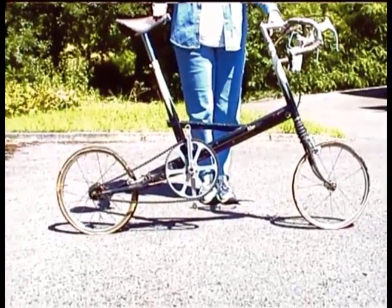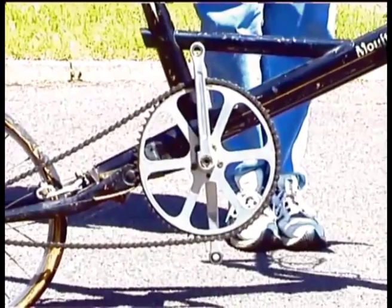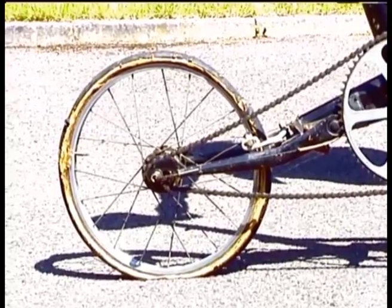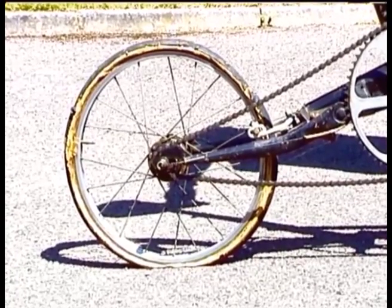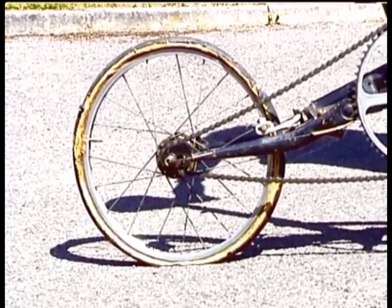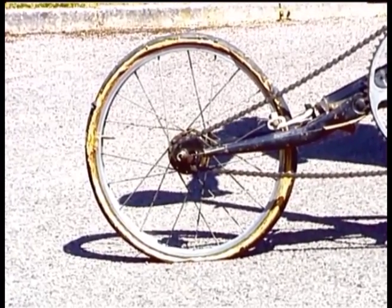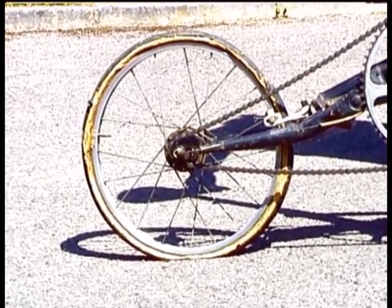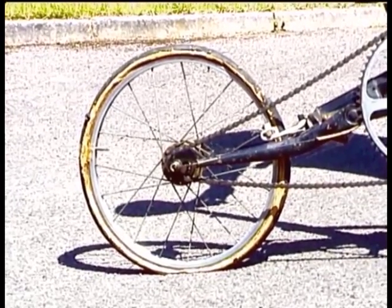You've got the big chain wheel there, which we'll zoom in on now. Quite a nice little beastie there. And that was driving a Sturmey Archer FC close ratio 4-speed, actually a 1958 one, because by this time those had gone out of production. Now you can see some very tatty looking tyres there. That's the process of time, decay of the best part of 40 years on very thin tubulars. These were nominally 18-inch tubulars, but of course tubular sizes date from the time when tubulars were about 1.75 inches in diameter, and they'd shrunk down to rather less than that, so the real diameter was about 16 inches. And those were obviously the format used on the early racing Moultons.